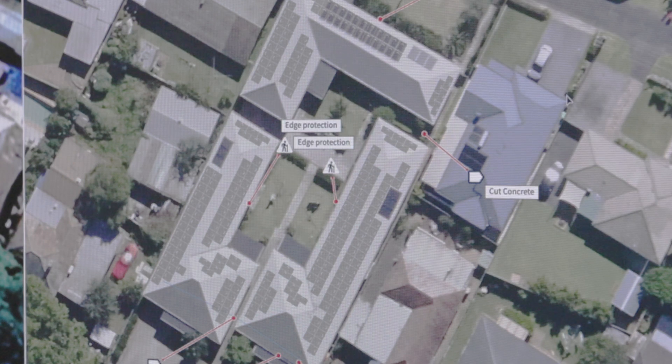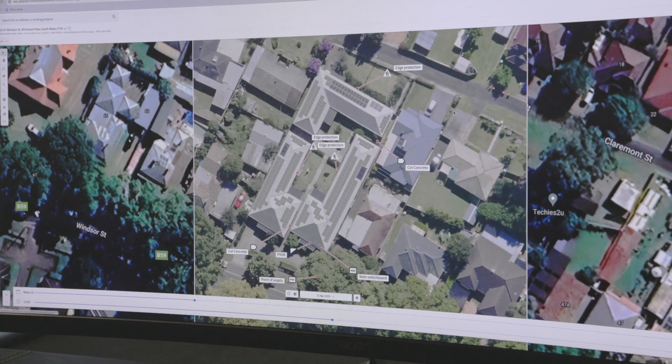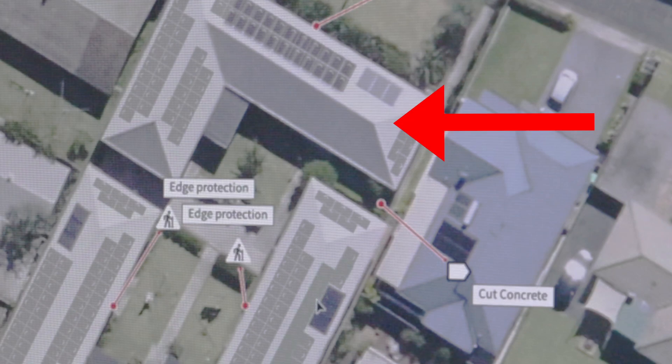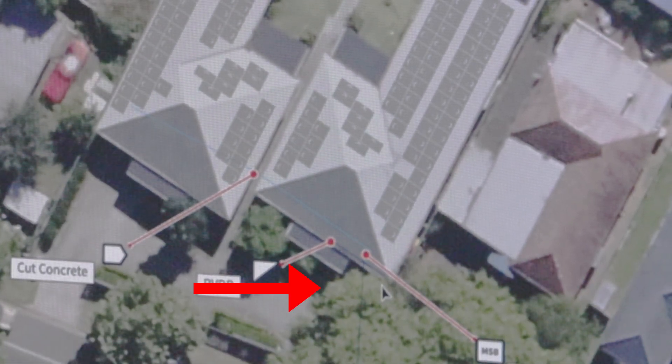In total, we've used 14 roof faces to get our 228 panels spread across the north, east and west roofs. The advantage of having panels across the eastern, northern and western roof is that this building will generate really strong numbers throughout the entire day from sunrise to sunset. The panels were spread across three separate buildings on the one site, which meant we needed to get cables from building to building, all coming back to the main switchboard in the far southern corner of the property.